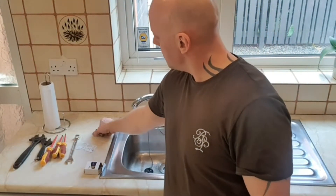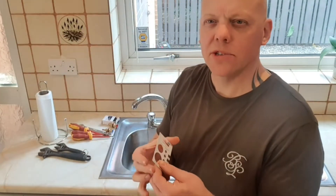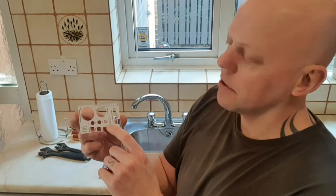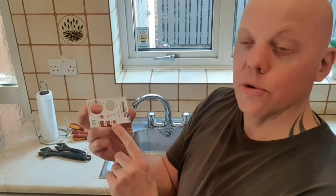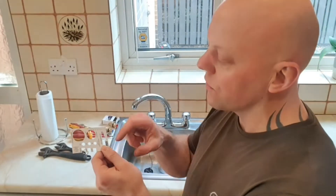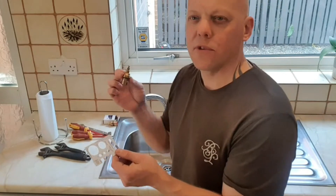Here's what you're going to need: new tap glands, a 17mm spanner, a selection of screwdrivers, a couple of shifters, and kitchen roll or paper towel in case it goes wrong. I've also got this measuring device available from Screwfix — I'll put a link below. It tells you the tap gland size you need, the number of splines on the top, and the height, so you can measure before buying parts.